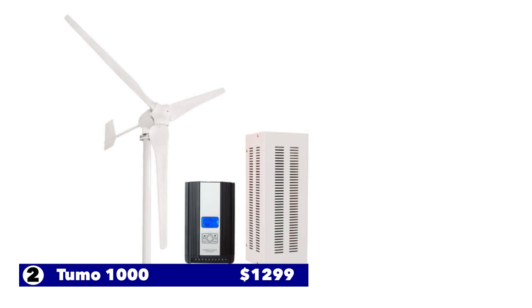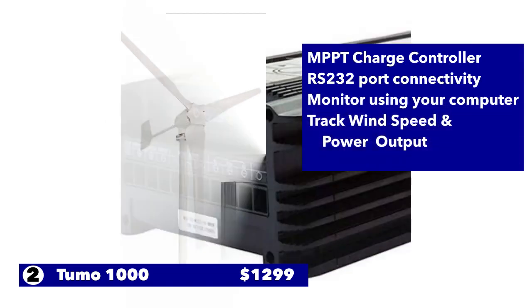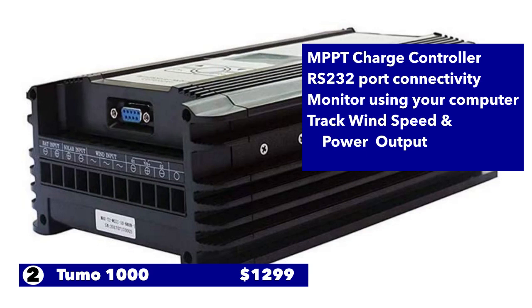It comes standard with an MPPT charge controller. An interesting option is it also has a data port. You can use a standard RS-232 cable to communicate with the wind turbine using your computer. This is excellent for monitoring. You'll be able to monitor wind speed, how much power the unit is producing, and when it's producing power. It's worth the effort to get your RS-232 connectivity with the Tumo 1000.